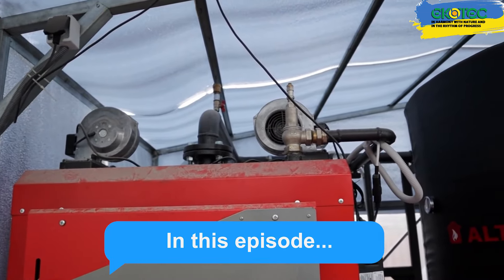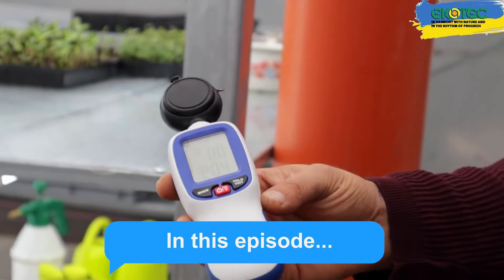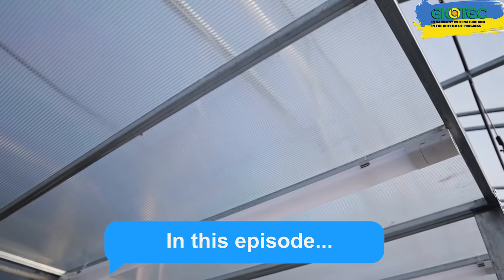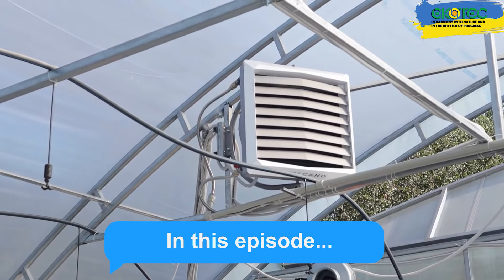Our smaller greenhouse accumulates less excess moisture. An expansion tank is a must. The temperature rises quite quickly. It's better when it's higher — it won't overheat as much. For winter, it's better when it's lower. As soon as the temperature drops by 3 degrees from the set point, the fans turn on again.